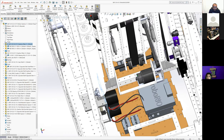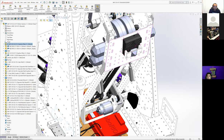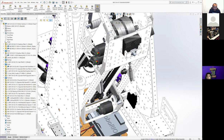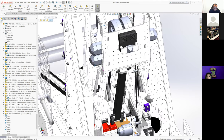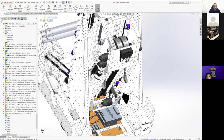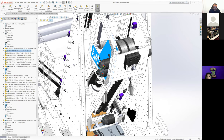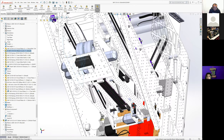This was definitely a little tricky as we were laser cutting all of these side gussets. None of these are metal, all of these gussets are plastic, so we can do it on a laser cutter. Most of them, all of them on our competition robots, are Delrin. They're a little bit stiffer than polycarb, so they don't flex as much. And then these inner panels were polycarb for some of them. I don't think any of these bigger ones got to be Delrin, right? I don't think so.